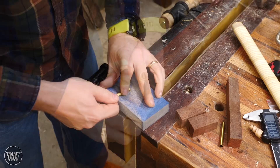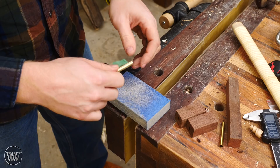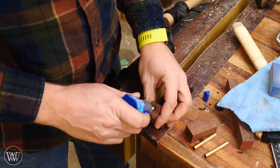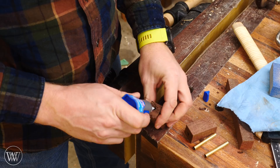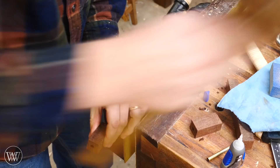Next I need to glue this in place, but to make sure the glue adheres well, I'm going to scratch it up with some sandpaper. The sandpaper will put scratches around the ring so that the glue has something to adhere to and lock it in place. The only glue I had on hand was gel super glue, but it worked well. I squeezed them in — they were loose enough to push in by hand, though it took a good bit of force. The last little bit I had to use a mallet to tap them down. I'm very happy with the fit on them — that's about the force I like. Any more and you start ruining it; any less and it might loosen up.